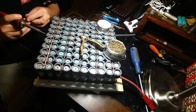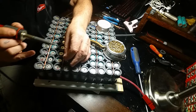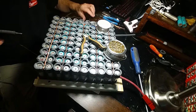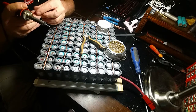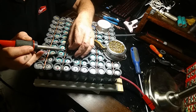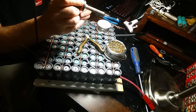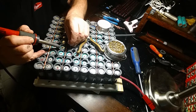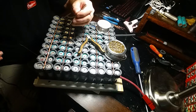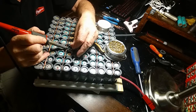Now here I'm beginning to actually solder the wire from the battery to the bus bar. These are the fine wires I had left over when I was building the bus bars. Some people actually use these for fuse wires, but my experience with that was bad — you would think this small wire would blow very quickly, but it actually takes about 10 amps. If you go to Average Joe's channel, he did about 10 videos on testing different wire, and if I recall correctly these blew at about 10 amps.